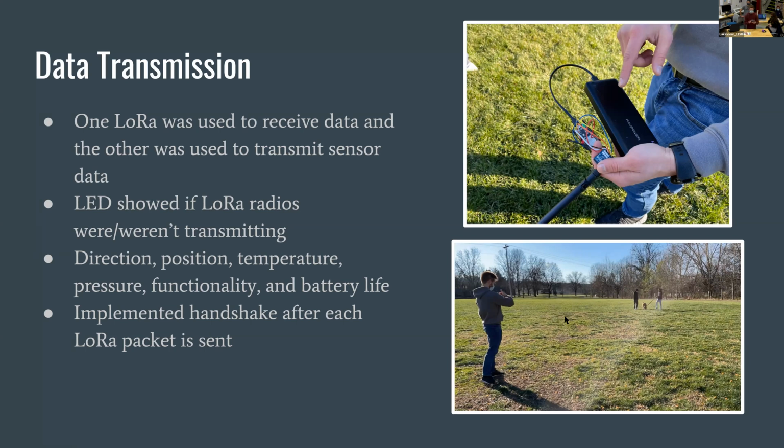So as Kamir mentioned, there are these LEDs. I have no idea how well they come up on camera. There's a green, red, and yellow LED right here. Whenever the red is lighting, like right now, that means that it hasn't received communication in more than 10 seconds. Obviously, that's a very fast timer for calling a caller offline, but that's just because our testing is over the course of 30 minutes instead of months. There's a green LED, which flashes twice if it receives a successful transmission. And the yellow LED indicates if there's an issue with the Wi-Fi.